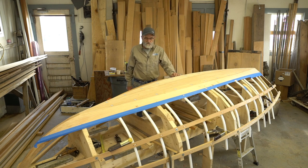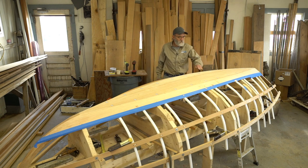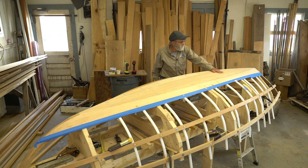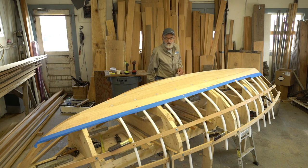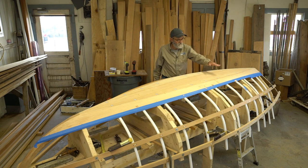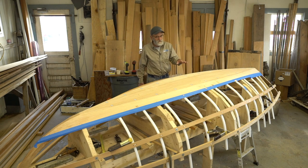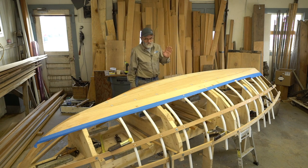We're just going to cut a piece out and lay it over the boat and wet it out. It has to happen kind of quickly because I don't want it going off on me — while it's still wet, I'm going to put the second layer of bottom plank over the top of that and weight that down with lead weights. I've already tested that all out.